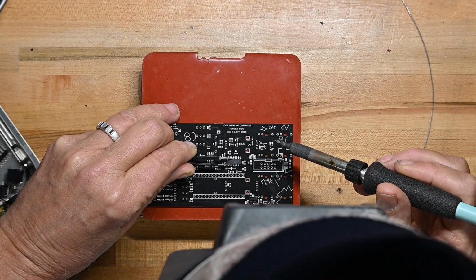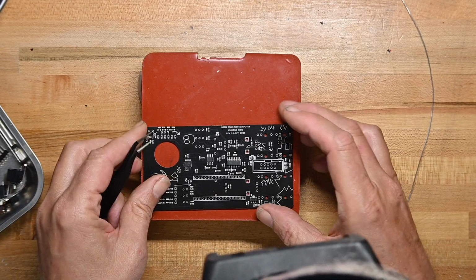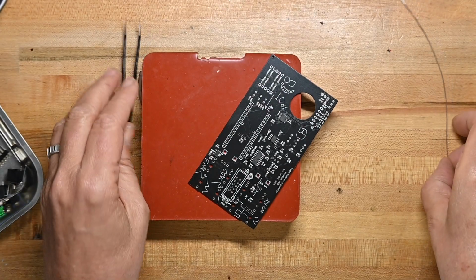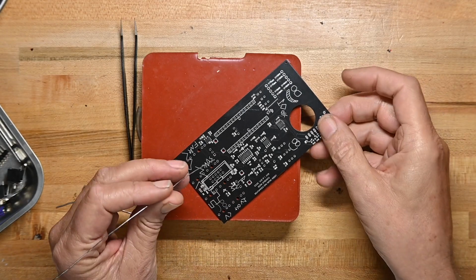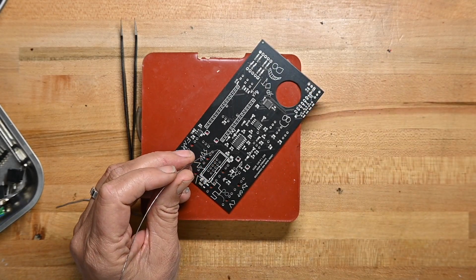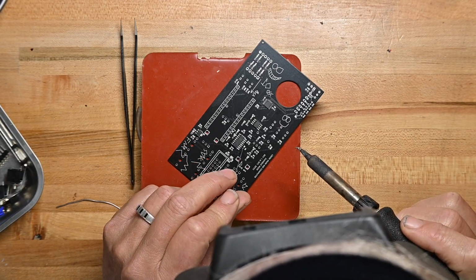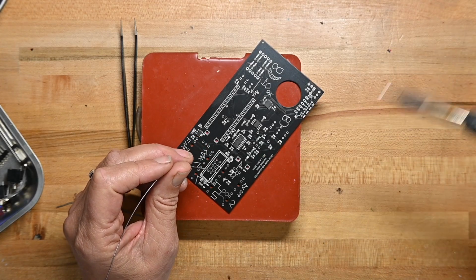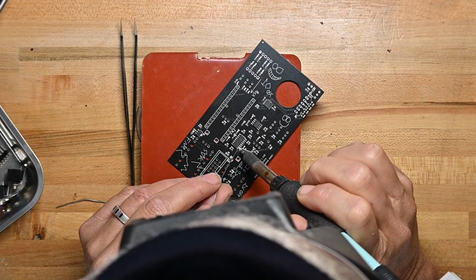You might have seen the chip sank right down onto the board. So now it is in place, and if I'm reasonably careful, I won't nudge it away, and part of that care is I'm going to solder the opposite side from where I just put the lockdown solder bead so I don't disturb it. Now, one thing that we will want to be very careful about here is you'll see there's a capacitor and a resistor here that we certainly don't want to touch with our soldering iron. I'm not going to use any additional flux on this. I don't think I need to.